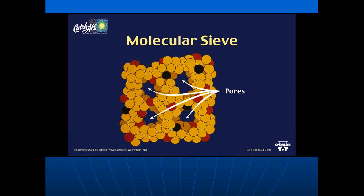Acid molecules, refrigerant molecules, oil, and oil additive molecules are very large and will never fit into the tiny pores of molecular sieve. We're talking at the molecular level — far smaller than a human hair, which is around 39 microns. So molecular sieve alone doesn't attack acids in the system.